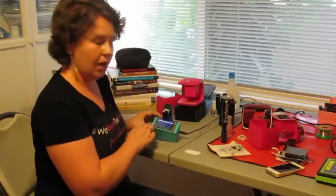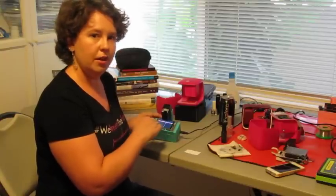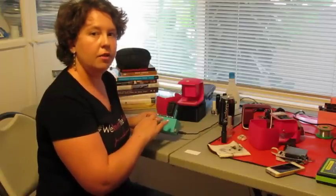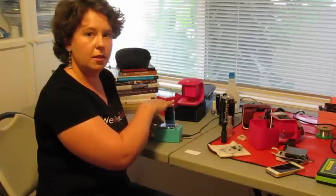On here we have a resistive touch screen — this is how we'll know where the finger is. And we've got some guides to let you know where things are going to happen. On the inside is an Arduino Uno, and then we have our ink shield, which is what actually controls the cartridge that sits up here.